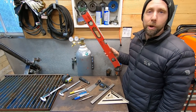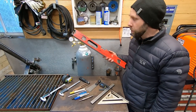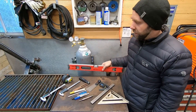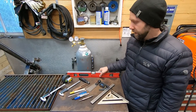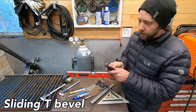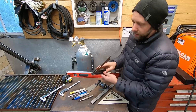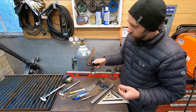This is just a basic two-foot carpenter's level. Some of these tools you'll already have in your shop — it crosses over from woodworking to metal. I use it for leveling up surfaces like tabletops. Angle finders are super helpful for finding certain angles and matching them. You can put it up to another workpiece, lock it down, and transfer the angle to something else. Super useful. These are like four bucks.